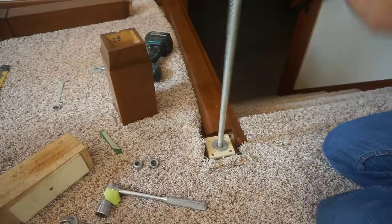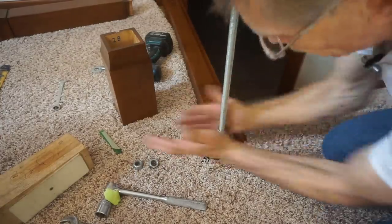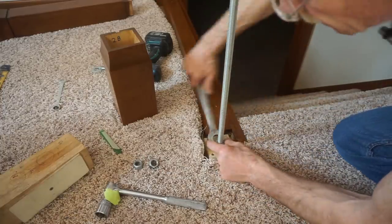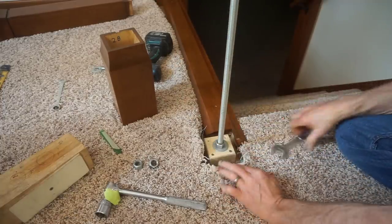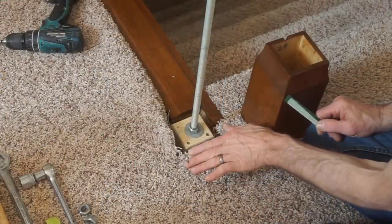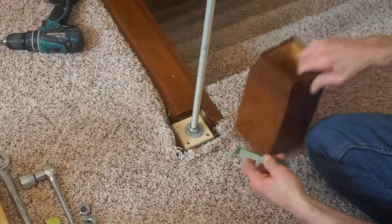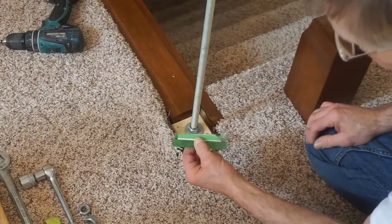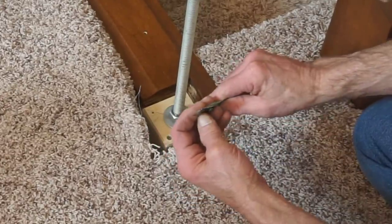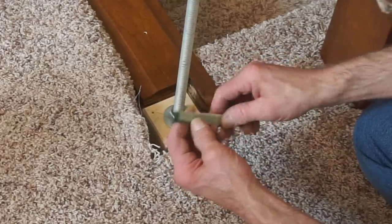Because I'm doing this a bit bass-ackwards, I now place the washer and run the nut all the way back down. I'm not certain that an extra jam nut is necessary at the bottom, but as easy as it is to install, I thought, what the heck — it's not going to hurt, it can only help. On this particular newel post, the subfloor is just slightly out of level, so when I torque the newel post down it leans a bit to one side. To remedy that, I'm using two thin plastic shims — these plastic strips are strapping material from packaging on pallets. I keep a selection of different thicknesses on hand; plastic is durable and very dense, making for excellent shims.